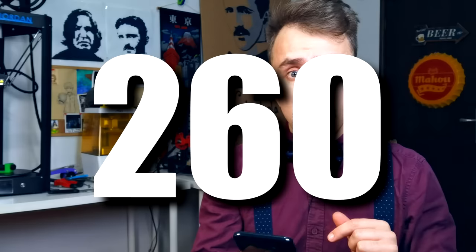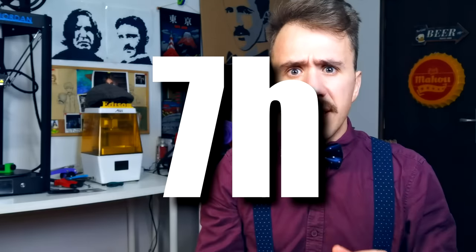But if I start at ambient temperature, to get to 1300 degrees Celsius, it would take me 260 increments? That's almost 7 hours to get it done! Well, that's a little bit impractical. I could switch the inbuilt controller for a microcontroller and implement a PID control of temperature. Yeah! Wait, that means I would have to disassemble the furnace. And probably break it. I don't want to break my furnace. The safest way to control the temperature is by using the buttons. But that means 260 trips to the attic.